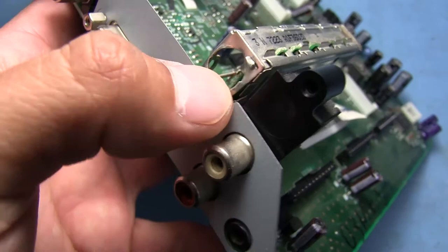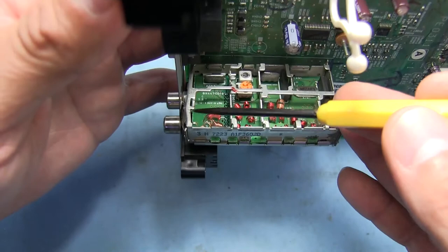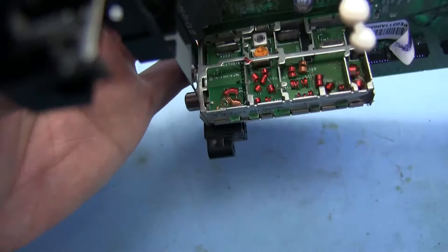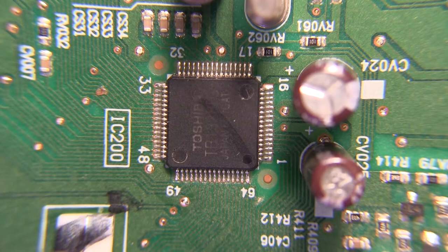On the tuner, we saw earlier that the coaxial connector got yanked off at some point — this thing got wrecked. Look at the inside of that — you can see those inductors that were right there, close to the input, got completely smashed and damaged. So I guess at one point they must have had that input used, but then after that they started using something else, like a cable box or satellite, so there was really no need for this anymore. That whole input section right there is pretty messed up.